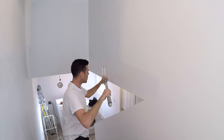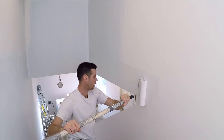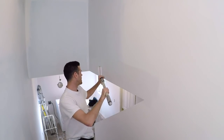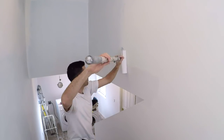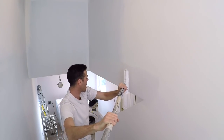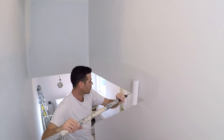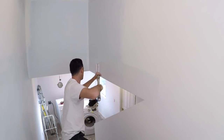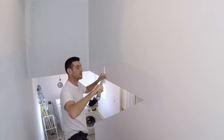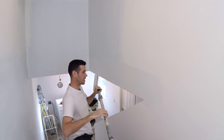What I'm going to do is this is kind of like coating the corner bead. First off, I'm not pressing very hard — the harder I press, the more likely it's going to spill over that edge. The second thing I'm doing is I'm also not rolling upwards. So as I'm pulling, I'm not going up. If anything, I'm actually pushing ever so slightly down — just very gently. It just takes a little bit longer to unload the paint onto a corner because you can't push as hard. As soon as you push hard, it spills over the other side.